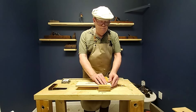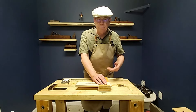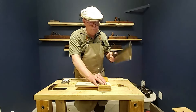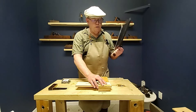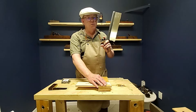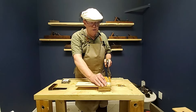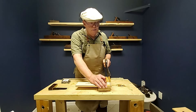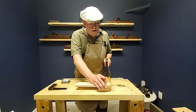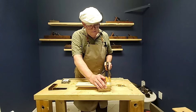In order to get your cut, place the board right up against the bench hook. I like to put mine in the vise, but any square surface would work. You can see — if you're going to crosscut, this is more of an English and American tradition as opposed to the bow saws. The bench hook may have come from that tradition. Now while I'm cutting here, some of you may notice that I'm standing a little bit taller.